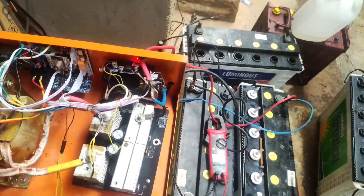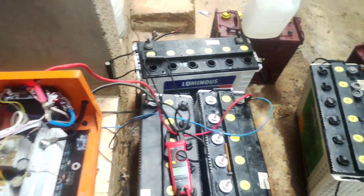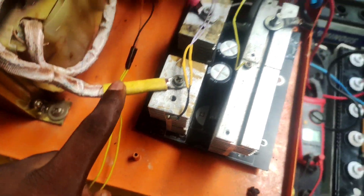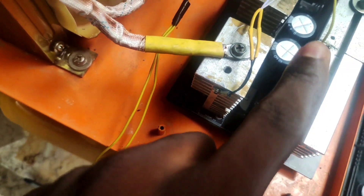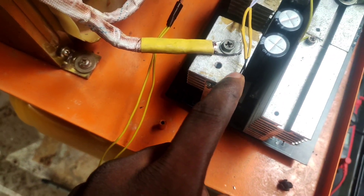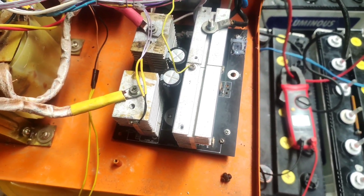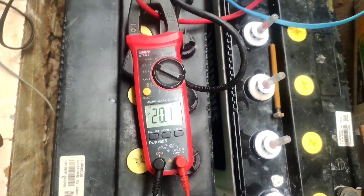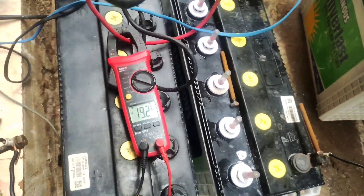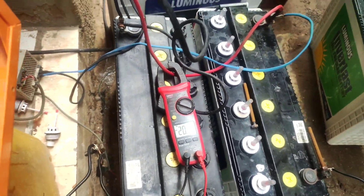The temperature is currently set to 100 degrees. Once it gets to 100 degrees, the low-side temperature sensor is going to stop charging. So if you want to charge at 40 amps and your cooling system is not sufficient, it's going to stop in the middle. It will still go up to 25 amps without oscillating between 24, 25, or 26 — no one-amp oscillation.